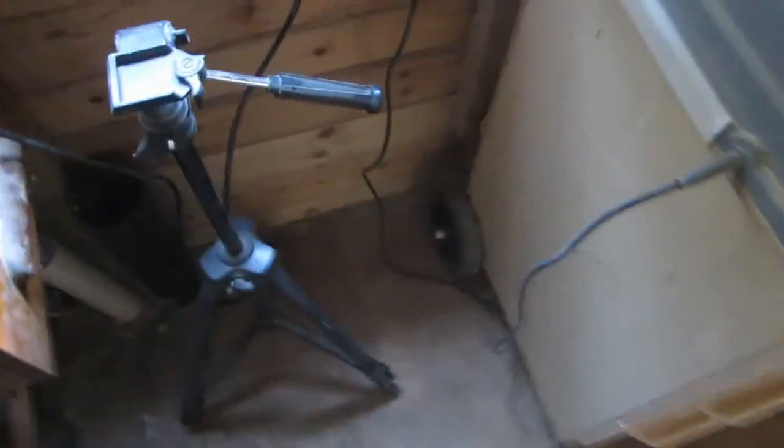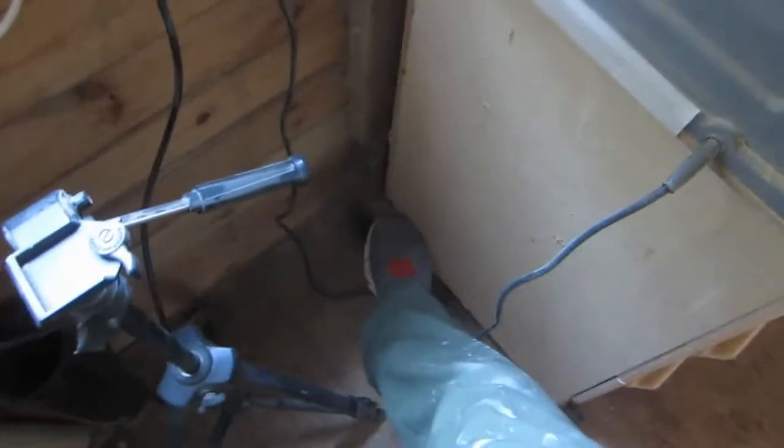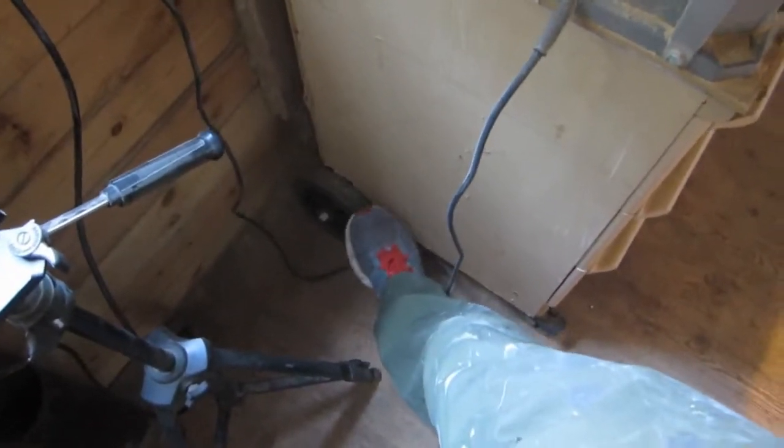You may have noticed it's on wheels. There are two trolley wheels on the front, and one of them has a brake so you can stop it wheeling about when you don't want it to. On the back there are big wheels attached via a bit of PVC pipe that goes across the bottom of the cabinet, screwed on, with the wheels sliding on the ends.